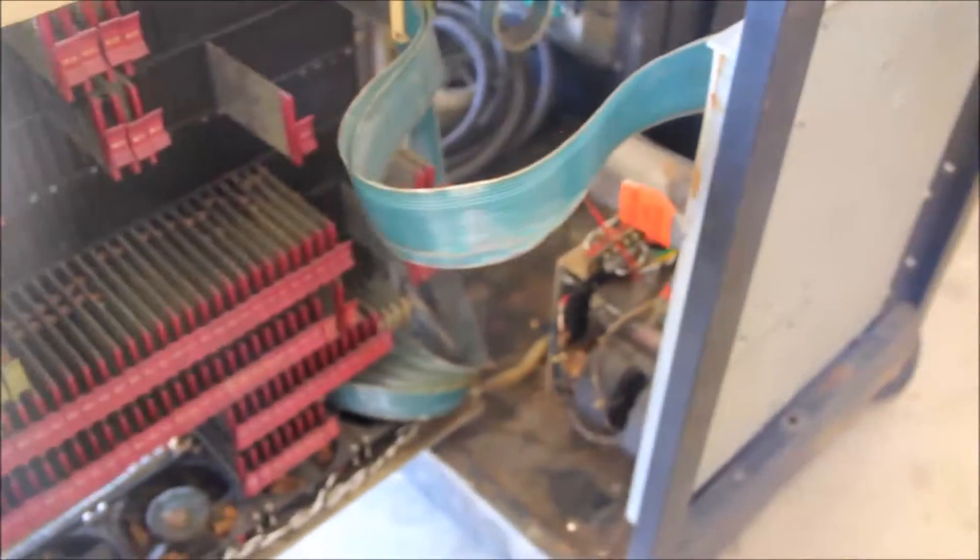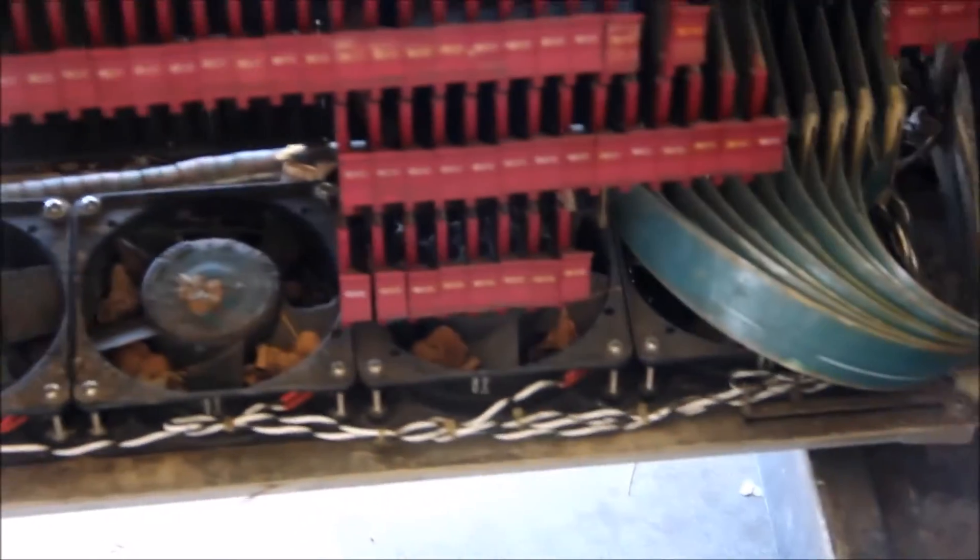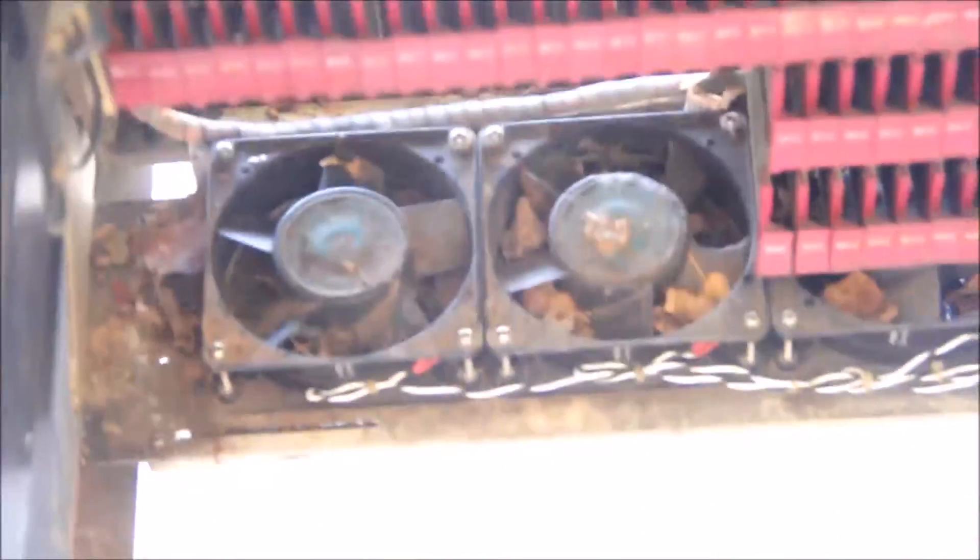Okay so let's go around and I'll show you the actual PDP-8 itself. Now unfortunately when I got this, some critter had actually built a nest right here inside the machine. You can see the fans themselves are a little bit messed up and the nest was literally right here in the middle of it. Thankfully since it's a vertically oriented board I think most of the damage was pretty limited to the fans themselves. The cards look okay and the connectors are gold. The main problem is the power cable right here — it's actually damaged and it's going to need to be rebuilt or replaced.